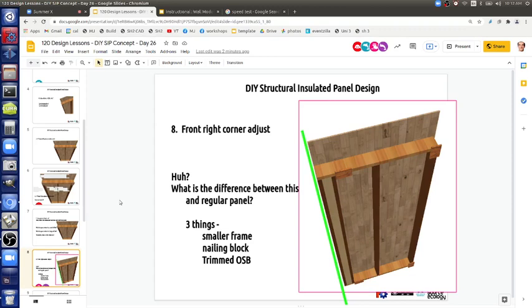The door is a finite dimension, and you have to take away from the door. It ends up that the dimensions end up being kind of weird on that. You have to have a specific space for the door. King and jack studs on the door, each one being 1.5, so there are particular constraints there on the dimensions. But you're saying do it everywhere, that'll be very wasteful. No, do it in the places where you need plates. Or I say do it everywhere because it's my natural inclination that if it's going to be a window or a door, it needs to be. And you guys do have the king studs, jack studs, everything is correct. All you've got to do is add another one.